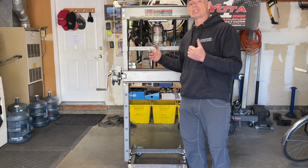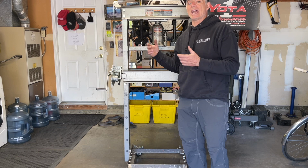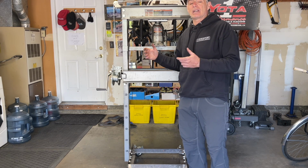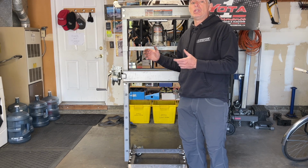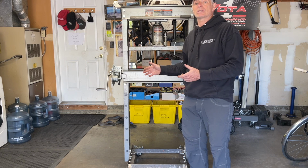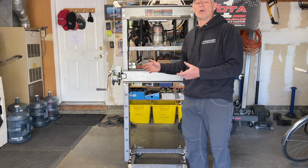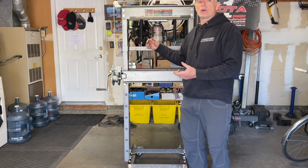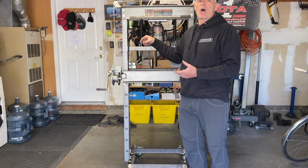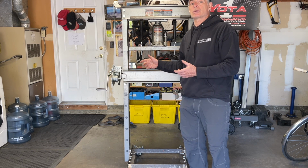So I do have a spare 3rd gen 4Runner axle and one of my buddy Dwayne's axle tools hooked up to it, and I want to demonstrate a couple different positions you would be getting your axle onto the Harbor Freight 20-ton press to do the necessary press work. The first orientation is to pretend that you're either pulling off the ABS tone ring and inner retainer, or you're pressing the axle shaft out of the bearing. So that's the one I'm going to demonstrate first.